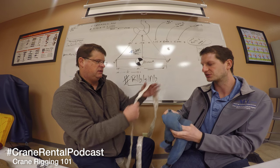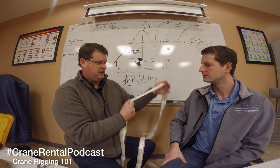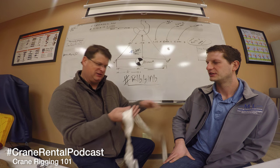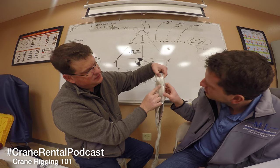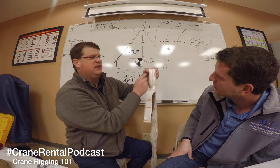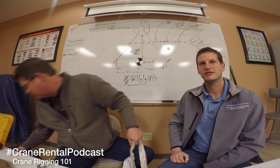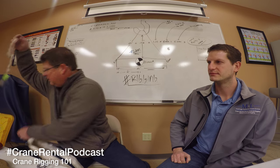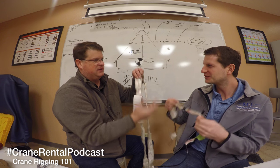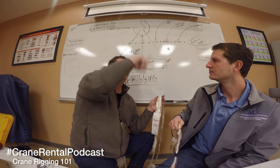The cover material is like a denim material. What I like about these round slings is that inspecting them is really a feel item - you've got to run your hands over it. If you have a kink or something, what you're feeling for when you massage this sling is knots, which are normal - that's just where they've been spooling the fiber from one spool to the next making a special little knot and continuing on. The fiber itself basically feels like a very light yarn - and that's what's holding this load up. That's why it's so important to inspect properly.